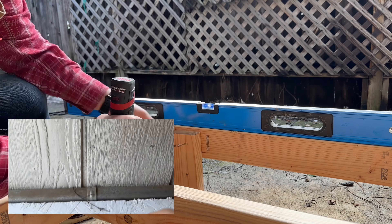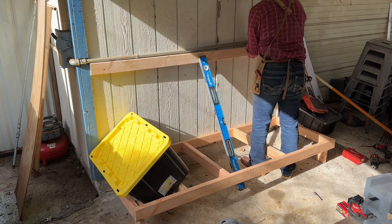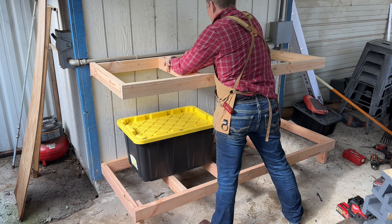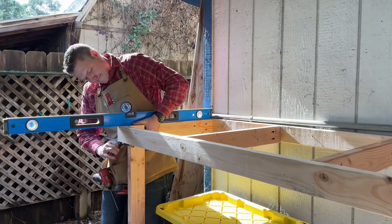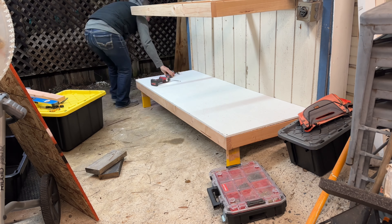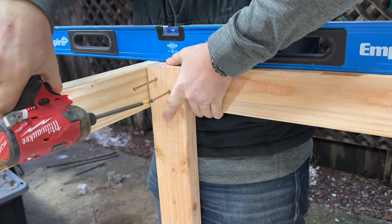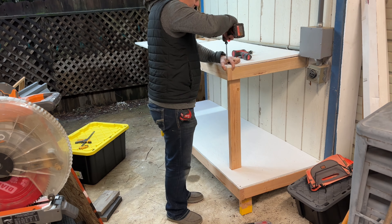We're going to be using a level here. The shelf is level, and then we'll put the legs on temporarily before we paint them. Now we're going to take a measurement for that second shelf and add that into the wall. We're going to rinse and repeat as far as the shelf is concerned — we did that one off camera. For those bottom legs, we're actually going to put a coat of paint on them so that there is no moisture migrating from the concrete up into them. Then we added some OSB — oriented strand board — and fixed it on each of the corners just to keep it in place. As for the legs for the second shelf, we measured it, got it level, cut it down to size, and attached it before adding that top OSB board.